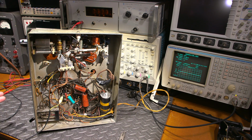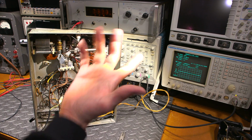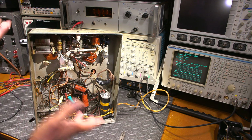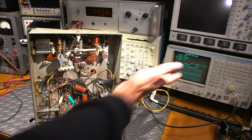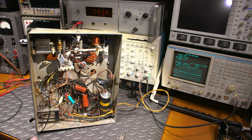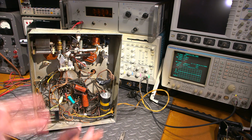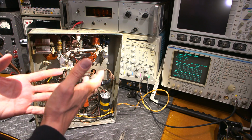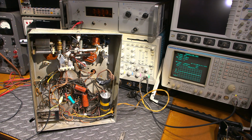Who knows what's going on in here. So the bottom line is it works. And basically, if I wanted to, I could throw another rock in here and put it on an AM frequency and just leave things the way they are, clean it up, of course, and use the thing. It's modulating to 100%. You fix up the audio section, and away it goes. So technically, the receiver and the transmitter from that old forestry receiver and transmitter setup both work. From 1940 something or other.